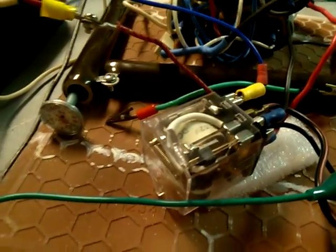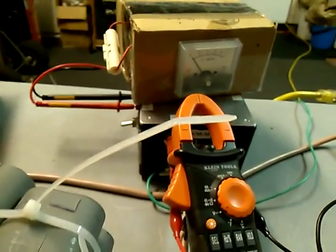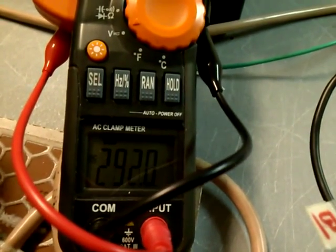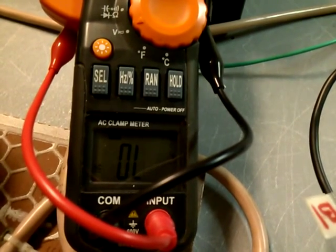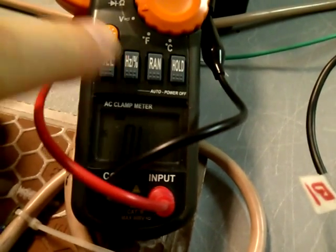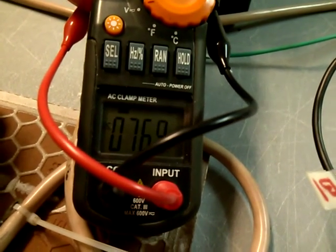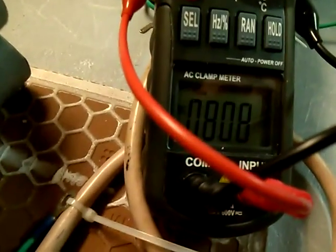The relay right here is 30 amps and we're going to turn the variac on to power up. We have a full bridge rectifier with a filter and we're looking at about a thousand volts — we need about 700 to get the spark plug going. That's AC — let's turn it back on DC. There we go, the spark plug is just starting. Now we're going to turn it up to a thousand volts.